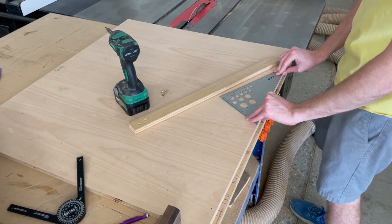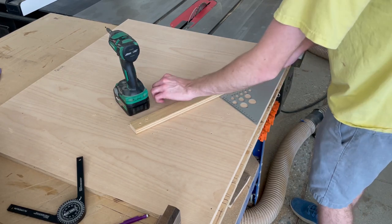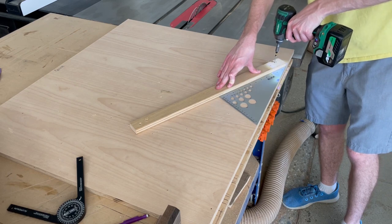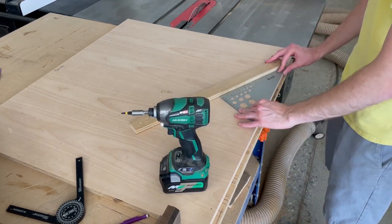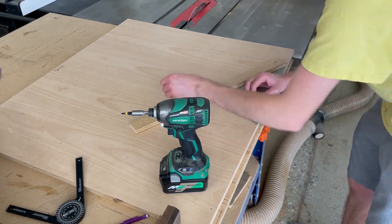After I have my lumber broken down, I'm going to make a plywood table saw sled to cut the angles I need. To do this, I'll set up my table saw fence so that the edge of the plywood is right up against the blade. Then, I'll set my thin piece of plywood at a 30 degree angle from the cutting edge by screwing it to the sled.